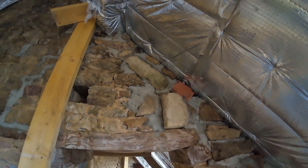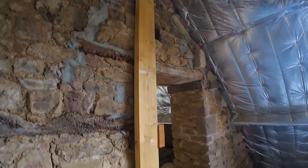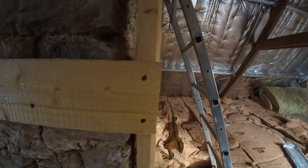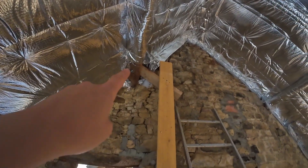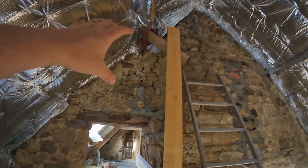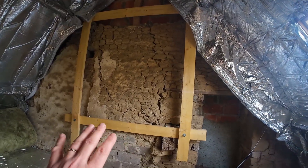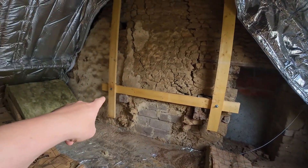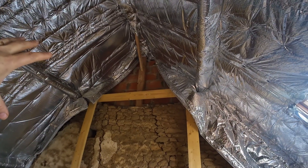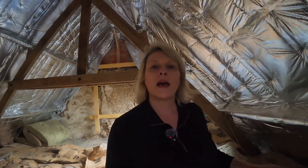We finished strengthening the wall here. It doesn't have to look pretty, just has to be strong. At the top we've tied in a beam, brought it down, bolted it into the purlin, and that gives us a bit of strength against uplift for the wall itself. Over here we've done pretty much the same thing — bolted through and connected into the oak beams down here, then tied into the purlins on the roof — which will stop the roof lifting off if there's a gale. We've done the same on the other side of this wall too.